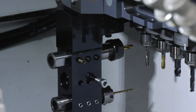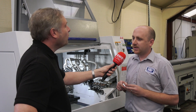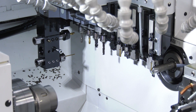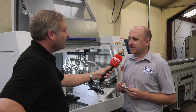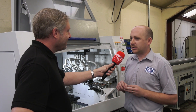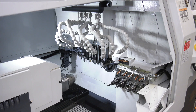In terms of driven tooling — front and back end? We've got four on the front with an option to fit the arm with a manual B axis, taking it up to seven, and we've got five live tools on the back, plus three deep hole drilling tools next to the sub spindle for a few extra tools. We've drilled 180mm on there. That gives you total flexibility in terms of parts you're manufacturing — definitely, especially where you need extra drill length next to the sub spindle, providing you watch for clashes with back-working tools.